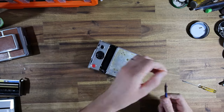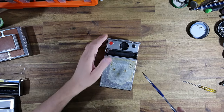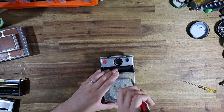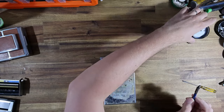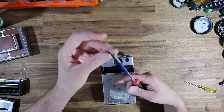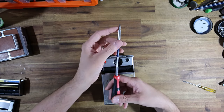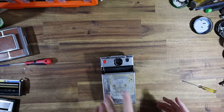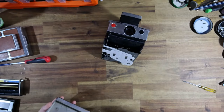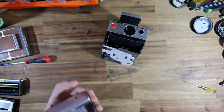The tips I'm using for my screwdriver - this is a Model 1 camera, actually the final generation of Model 1s right before they turned it into an Alpha. As a result, it uses square-headed screws, so I've got my proper square-headed screwdriver. These were bits that a technician had custom-made by a factory years ago - high tensile bits that cost about 75 Australian dollars each at the time. I bought two of them and they have been very, very good. A factory with high tensile parts just does a much better job than I can ever do.